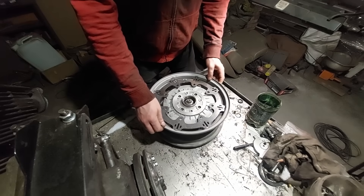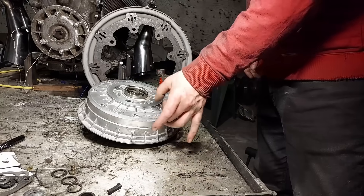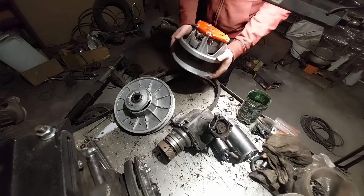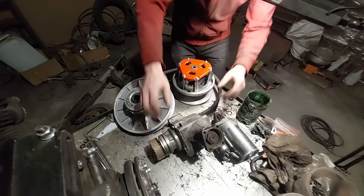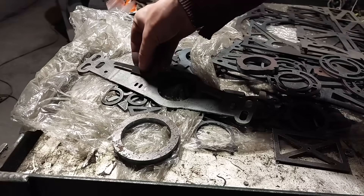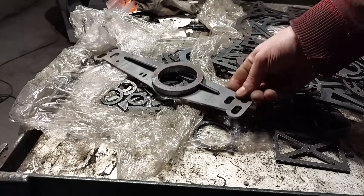Now let's peek into coming videos. First, I thought to use Lada car brake drums as hubs, but they're made of aluminum silicon alloy, so they'll probably crack even if I drop them on the floor. If you've got any ideas on drum brakes, please share them in the comments. I also bought a Soviet snowmobile CVT set – it is tuned for low-revving 4-stroke motors. A Honda CR-V transfer case will serve as the bevel gear. I already have a CVT case designed and plasma-cut – it looks like a heap of pretty metal pieces, but these pieces can't be assembled yet.